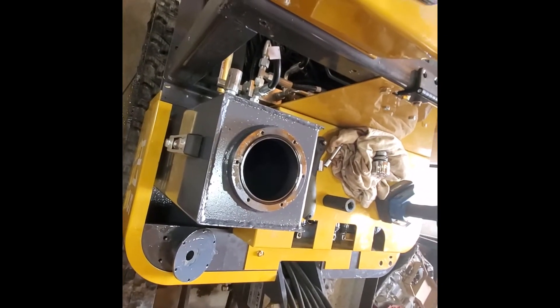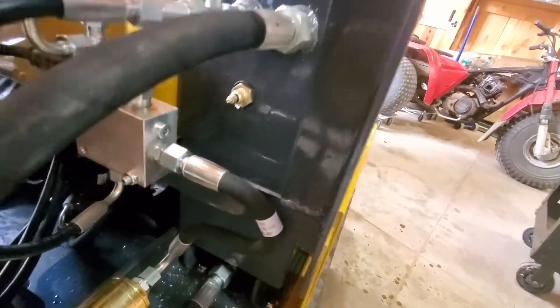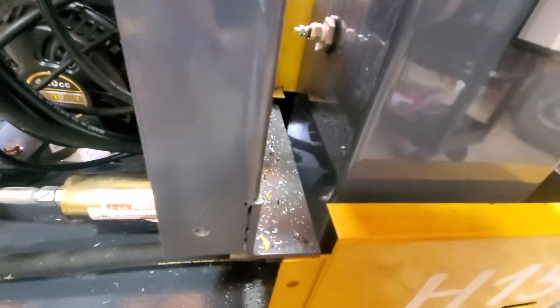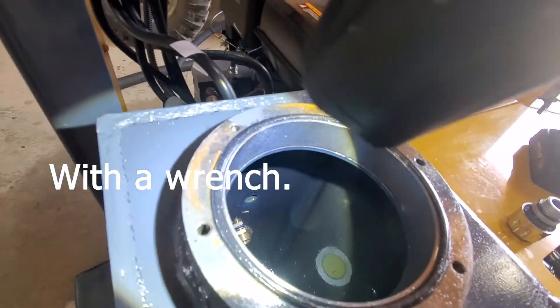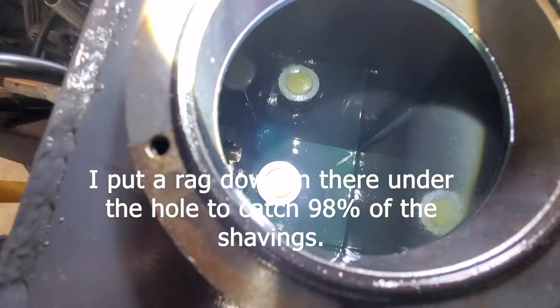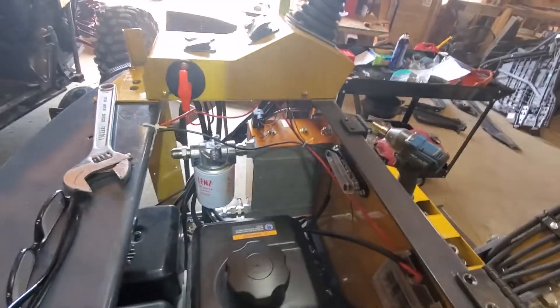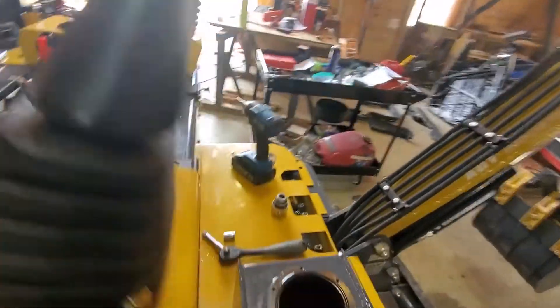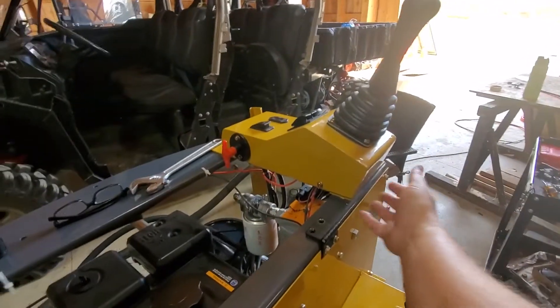This worked out really well — we have that connector right there with the 1/8 NPT. I went slow. We did get a lot of metal shavings obviously, but down in the tank I could fit my hand in pretty well. There are one or two metal shavings down in there but not bad at all — there's actually a filter down in there already, and I added my own filter, so we shouldn't have any problems with any metal shavings. Now we're gonna put this back on, hook up the electrical, and I think I'm gonna put the gauge right here.